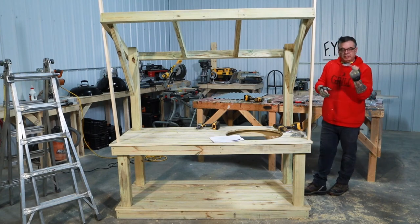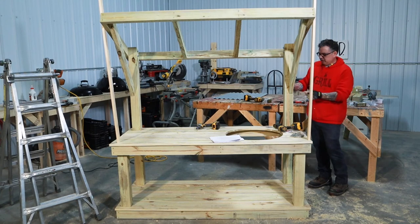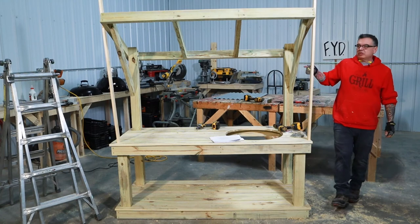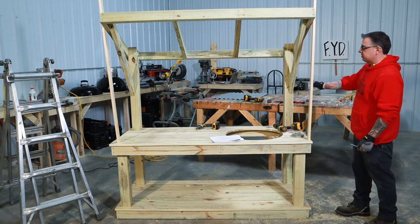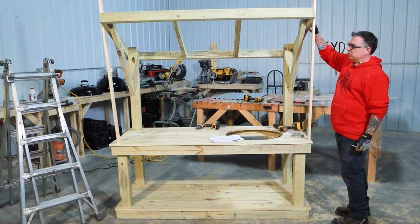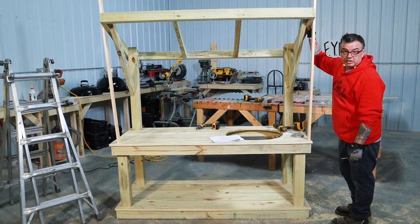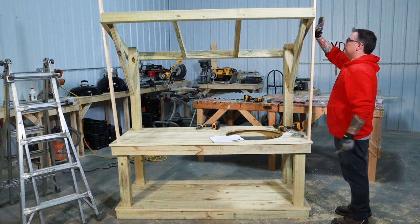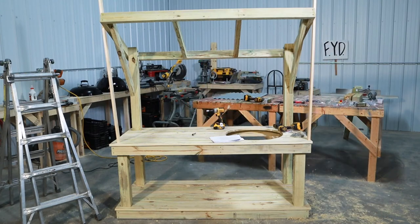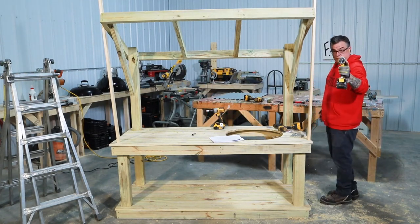Now I'm gonna put 6-inch, 1/4-inch lag through the back of the 4x4 into the angle brace. I'll secure it down here, and then I'll come back and put 2 lag screws with a washer, lock washer, and nut on the front. Should secure our roof into place. I'm gonna drill a 1/4-inch pilot hole for my lag screw.